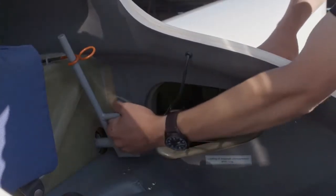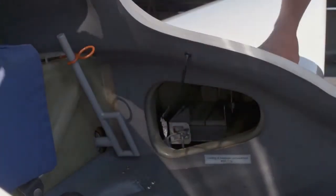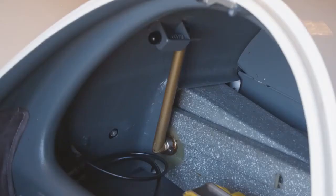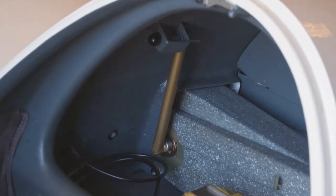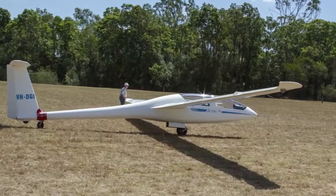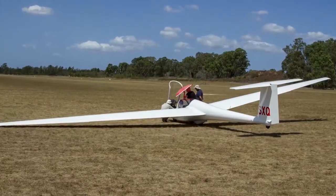Next, we check that the wings are properly secured to the glider. There are many different styles for wing pins and making sure that they are secure, so please ensure you look at the manual for the glider you are currently inspecting. Large span gliders, like two-seaters, often also have drag pins, so ensure that they are fitted and secure.